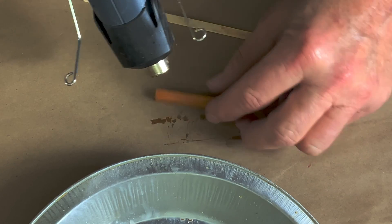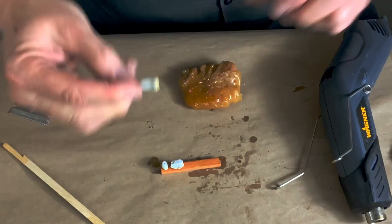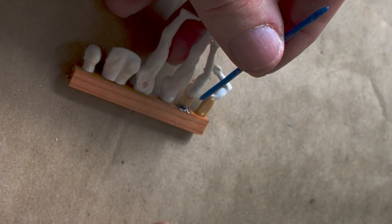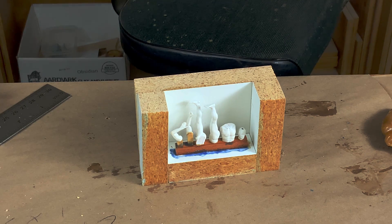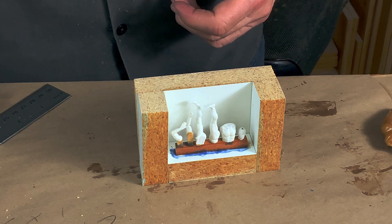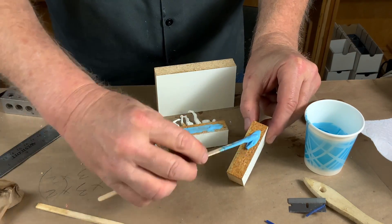Here I'm coating the piece of wood with beeswax so the molding rubber won't stick to it. Sticky wax is the best way to attach the parts to the tray, and I had to support the arms on little wooden sprues to hold them upright so they could pour and fill properly. I also cut out some small pieces of MDF — medium density fiberboard — covered in plastic laminate, which makes it perfect for mold cases. I coated the MDF in beeswax and made a gasket out of the same rubber I'm going to pour the mold with.